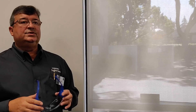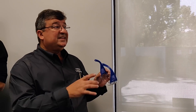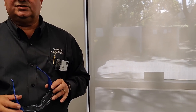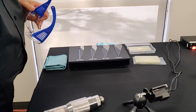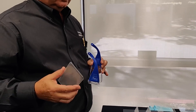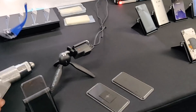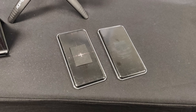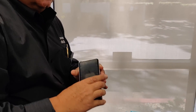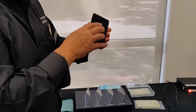Which leads me into the design. What I'm going to do today is take the same piece of glass — just a generic chemically strengthened glass — and show you that the structural design of the device makes a difference in the durability of the glass itself. I'm comparing apples to apples using the same piece. One structure has a completely solid surface supporting the back of the glass, and the other has neoprene filling a hole, so there's going to be some flexure in the glass.